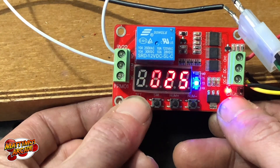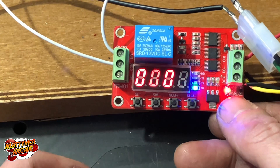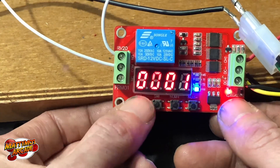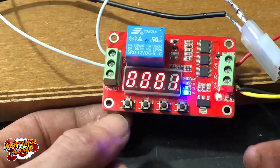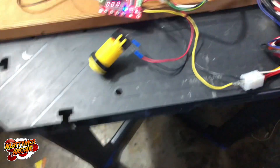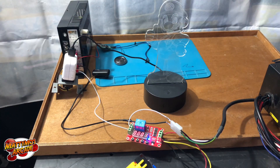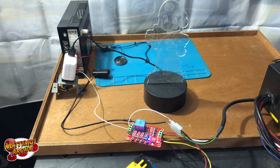The set button switches you to the next setting — the very last blue LED on the right is where you set your decimal point. T2 is in literal seconds, so 25 seconds is how long it's on. Number up raises the value, number down lowers it, and the switch button moves it back and forth. That's basically all it is — pretty simple, pretty handy, and there are lots of different modes. You can use lots of different sensors and switches, add audio, and put whatever sound you want on a little sound board like that custom greeting card board I got off Amazon for about twenty bucks.